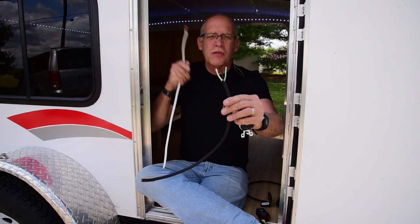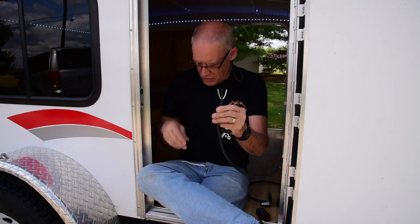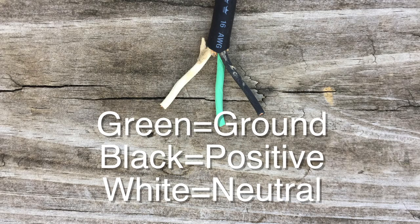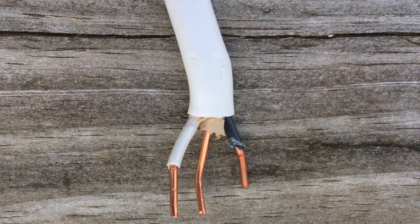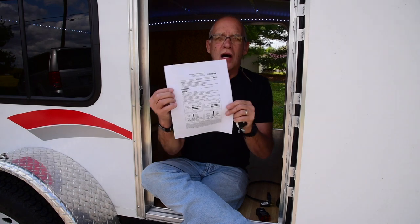I'm not going to show the actual wiring, but I want to briefly describe what we're working with. I mainly used this wire — it's similar to exactly what Runaway uses and it's also waterproof. It's three wires: green for ground, black for positive, and white for neutral. The other type is like typical house wiring: white, black, and a bare ground wire. If you're unsure, I'll post some YouTube links. A lot of times the outlets you use will be Leviton brand — look them up and they'll show diagrams for wiring. Just be careful and do your research or get someone who knows what they're doing.